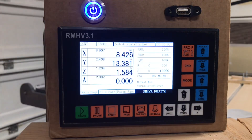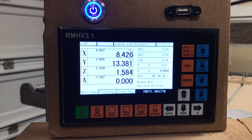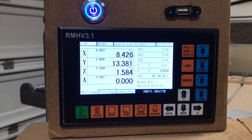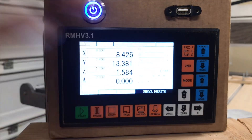Here is going to be the spindle speed that the spindle is going to run — that's set with the programming if you choose. For my needs, I choose to use the inverter to adjust the spindle speed, and I can do that while the program is running without having to fumble through the menus. Then you're going to have your coordinates where it's going to start, and then these are going to be operations to start and stop your spindle.